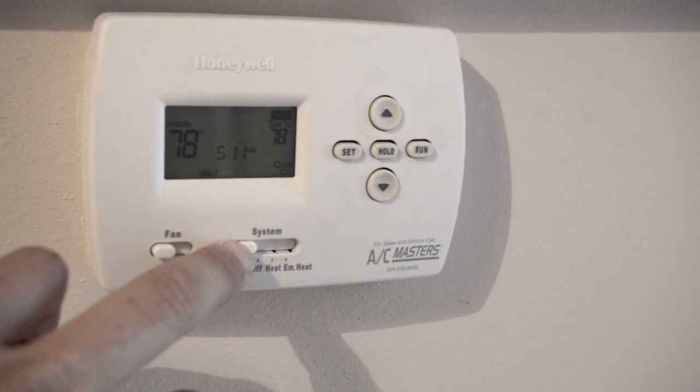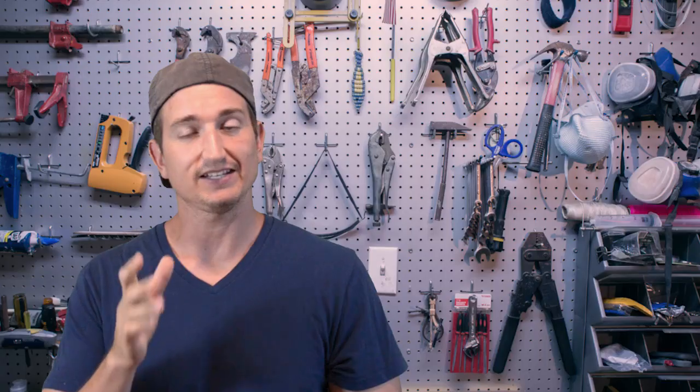The way to do this: go to the AC control in the house and turn the air conditioning off. The next thing — and this is very important — is to cut power to the condenser unit outside.